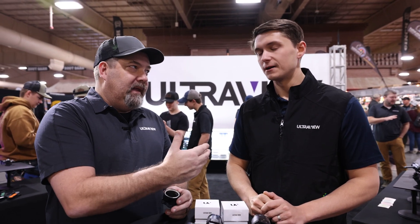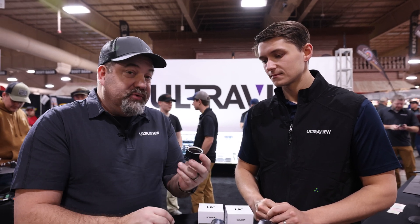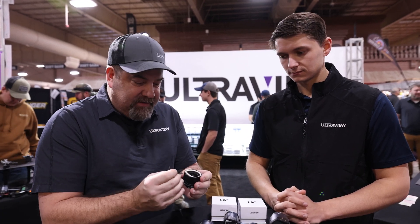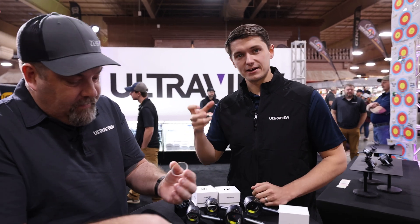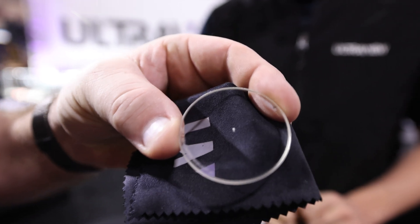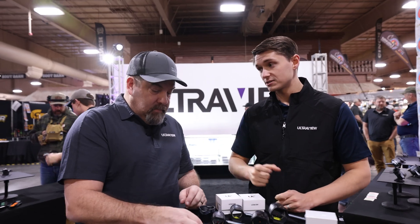Getting that bevel right took a lot of back and forth, and then we drill each and every single lens. Drilling plastic is one thing — this is drilling glass, two pieces of glass fused together at 19 thousandths. It is ridiculously hard; it is an engineering challenge to figure out how to get that hole. Normally when you drill a polycarbonate lens it's very easy. Drilling a glass lens is the next level of difficulty, and sometimes you get a chamfer — you don't want a big chamfer because you want a super small, tiny hole. What they've done here drilling these two high-quality glass lenses is absolutely amazing. That hole is super clean — you don't see that clean of a hole even on an easy polycarbonate lens to drill.